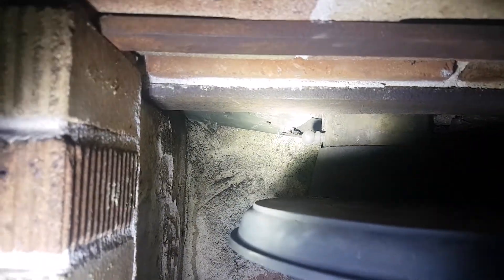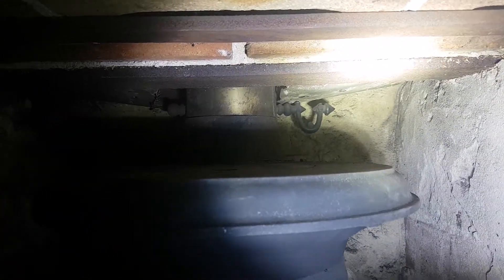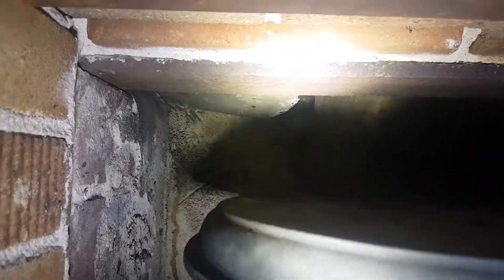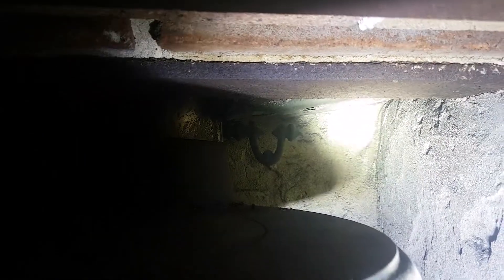The problem I've discovered is up in here there's a metal plate that goes across the top which surrounds the flue. And as you can see, it started to deteriorate and it's starting to fall in. There's some metal bracing across the top of the fire pit.